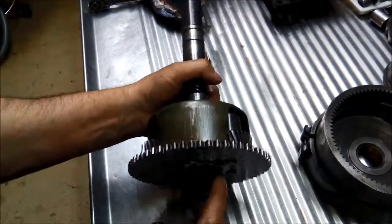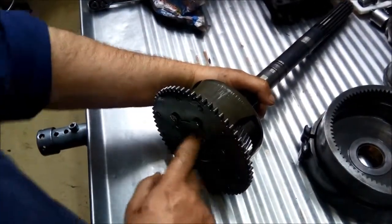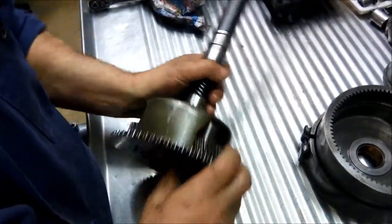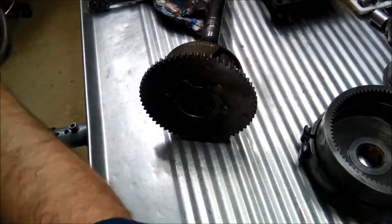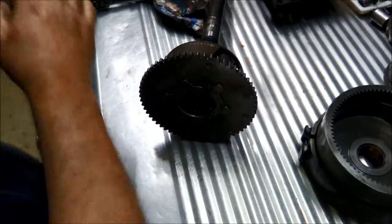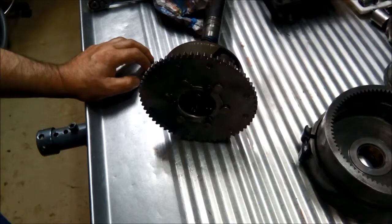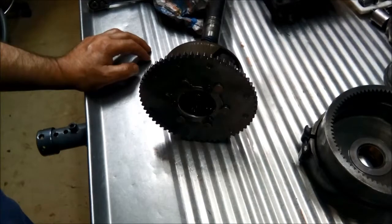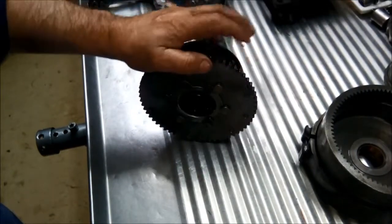We're going to pop these out and pull these gears out. There are little rollers in there that you'll need to repack before you can get the gears back in. If it's a cold day you can just use Vaseline or petroleum jelly. If it's a warmer day we actually use the thicker water pump grease - that'll just dissolve and get munched up in the gears when it starts running, so you don't have to worry about it blocking up a port or anything like that.